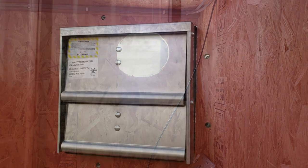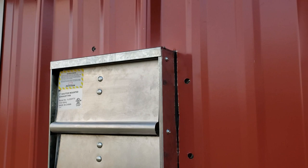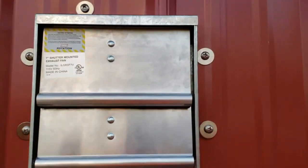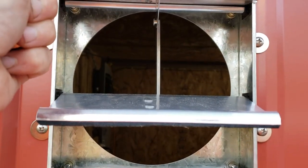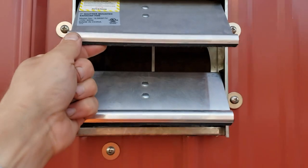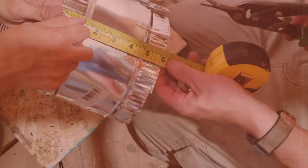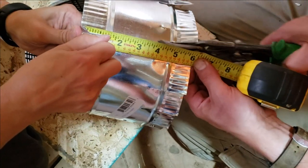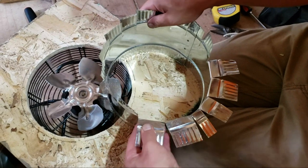I've got the hole in, and then I'll stick the shutter in first. Between the shutter and the wood there's a bunch of foam and then there's the plywood. Once I got this bolted in, you can see into the barn, and there's about six inches of space between this shutter and the plywood. I could just use the foam as a way of channeling it, but in case there's moisture, bees, flies and all that, I want to make a channel to keep the air flowing through it.